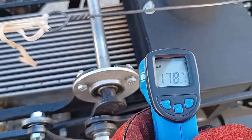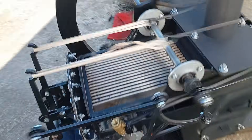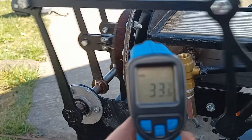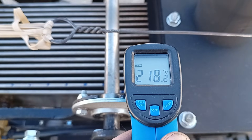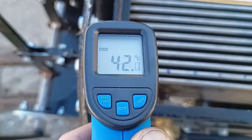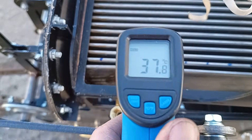I'm going to start the engine up now and take some readings along the cold side of the heat exchanger, just to see what the temperatures end up as. The cold side temperature of the diaphragm is about 30 degrees, so the cooler is actually working. The cold heat exchanger is about 33 degrees. I'll try and get some readings of the heat exchanger now — it's a bit awkward, and actually a bit dangerous, so I'm going to turn the engine off and then quickly take some temperatures. Two inches from the fire: 220 degrees. Three inches from the fire: not too bad. A nice differential temperature. It's quite interesting to note that in the last three inches the temperature doesn't change a great deal. I'd imagine there's a huge question mark over whether the cold heat exchanger is actually too big for this engine.